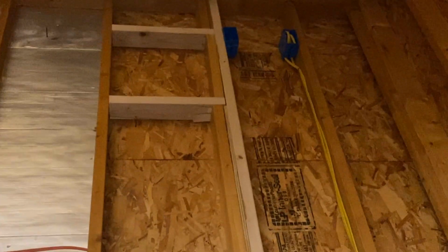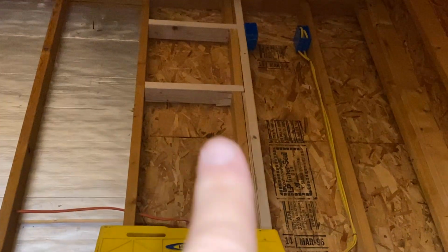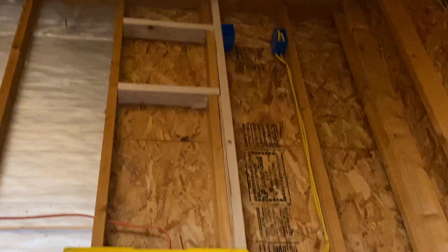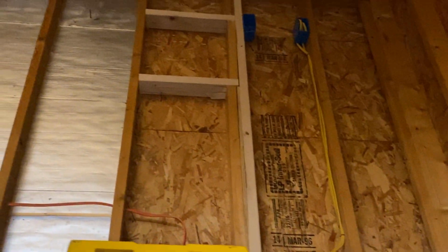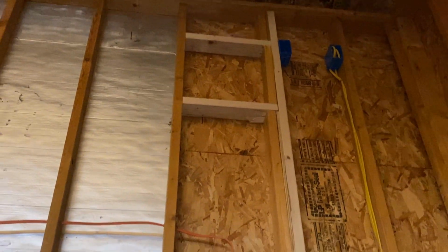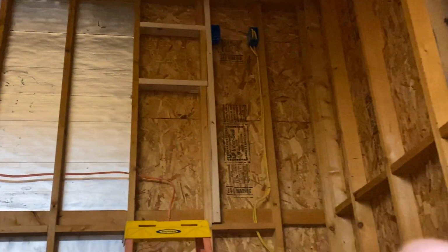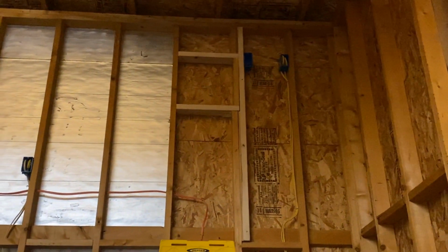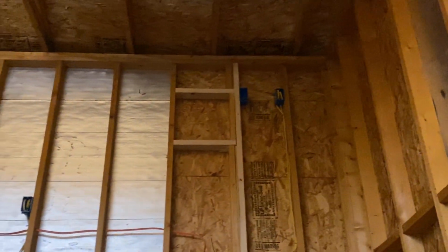And my fan hole is framed. So it's 15 by 15, give or take. I just sistered up that one joist all the way to that block there. And I nailed the hell out of it from both sides, so we should be good. So get this thing insulated and drywalled and find that hole and cut it out and put my fan in. And that's where I'll plug it. Next, I don't know what's next.